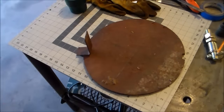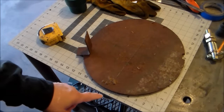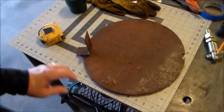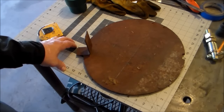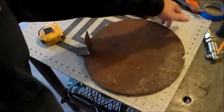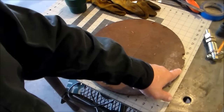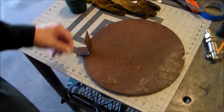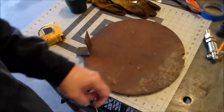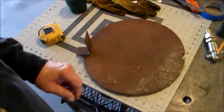What I've got right here is a circle that is 13 inches, and if you want to find the center of a circle it's kind of awkward sometimes. What he showed is if you have a grid, you could use a combination square or something like that. It just so happens I have this pad I use when I'm cutting kydex and it's measured off in inches. You just take your 13-inch measurement — that's going to be six and a half — so you look up your six-and-a-half-inch scale and put a mark. Because your circle is aligned on your grid, you put another mark at six and a half inches, then draw your line across, and the same way up and down. You've already got your center.